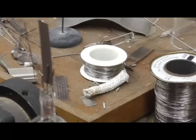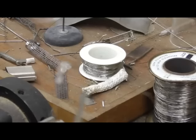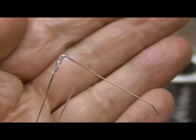Okay. And we have to put a glass bead on there because we can't have this contact the filament in the middle. We have to have an insulation there because we can't have an electrical contact or it'll short out half the filament. Okay, here's the piece fastened onto there. Put my hand there and it'll focus.